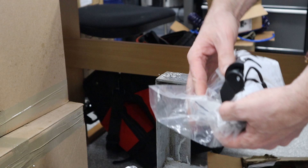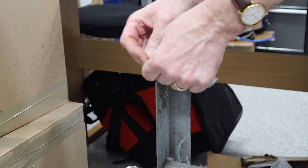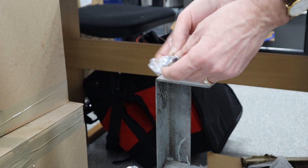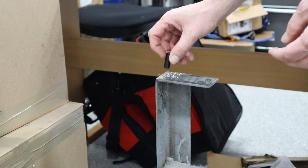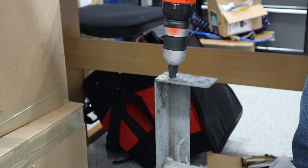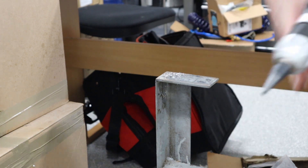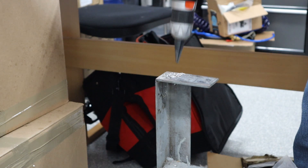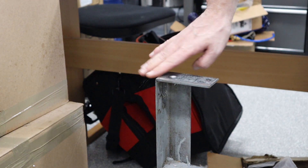The stud is a metric stud — I don't remember what size it is, but it's about half an inch. I'm pulling it out so I can test fit it in the hole to see how it is. It doesn't quite fit, so I have to drill just a little bit more. It almost fits, so a little bit more. If I did this again, I would have gotten a step drill with longer steps so I could drill it a little bit more easily. Okay, so that's drilled.